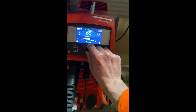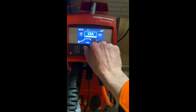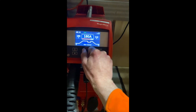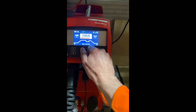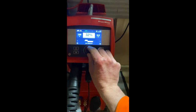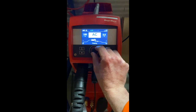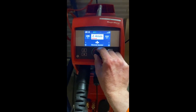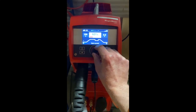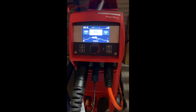I'm going to change it to AC and crank this up for 6mm - I'll start at 190 amps and see what happens. The AC balance is about where I like it, maybe a little less. I don't really use the cap shaping - I tend to just grind a pretty sharp, stubby point at a low angle, like 45 degrees, whereas for stainless I grind a really long taper on it.